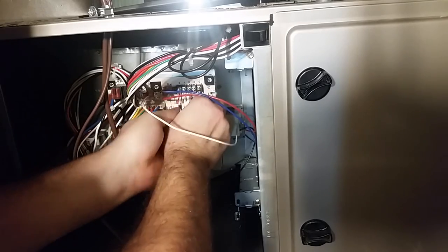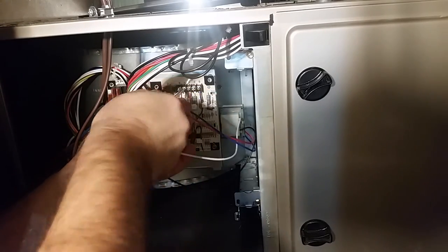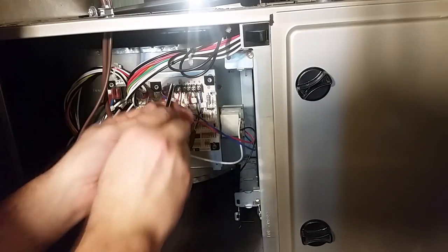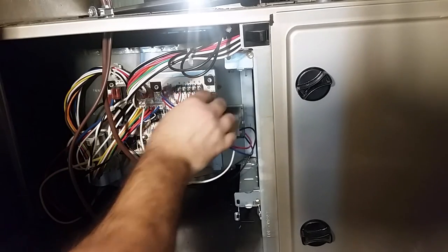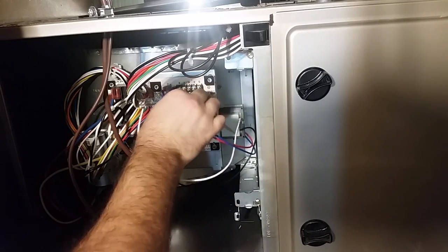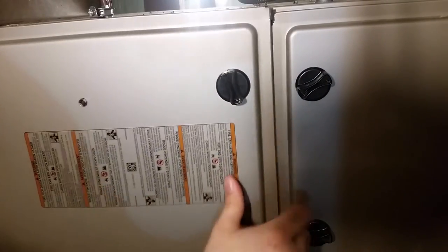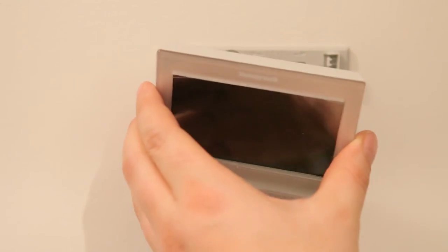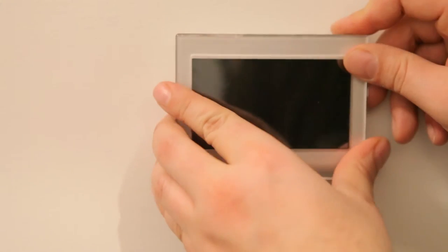It's just a Phillips head screwdriver to loosen the screws. You can stick the wires in underneath the little clamp jaws under the screw and re-tighten it back down. Because I'm already here, I also took the time to check each of the other wires and made sure they were snug and not going to come out by accident. With everything finished, I closed up the furnace and headed back upstairs. Before turning the power back on, I made sure to connect the thermostat to the mounting plate.